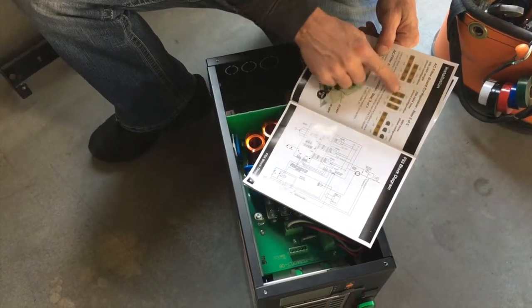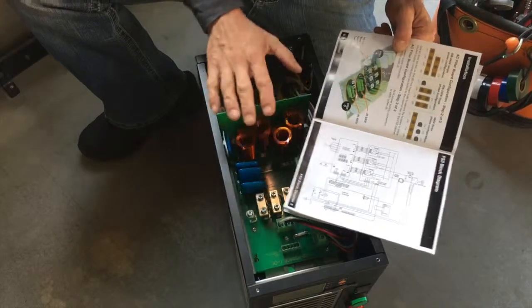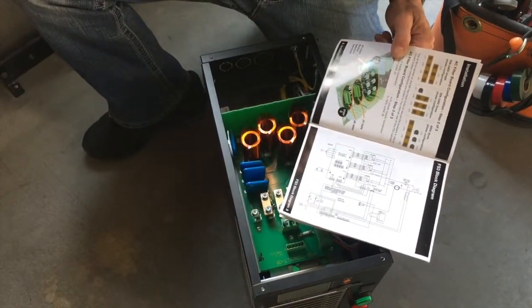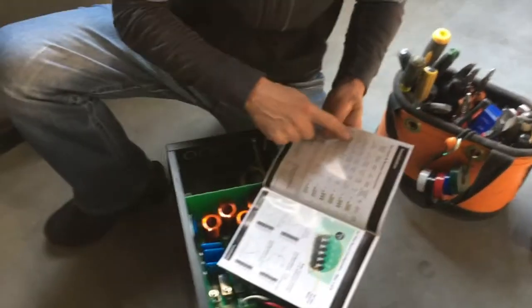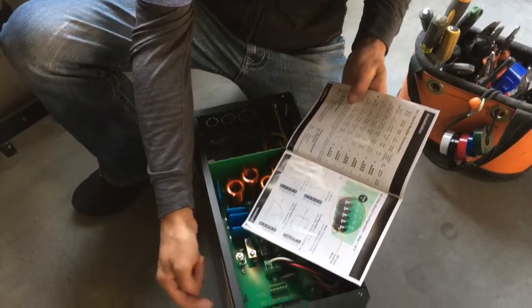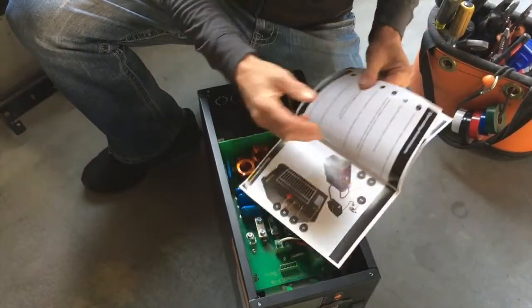Keep in mind they've already configured that 15% voltage drop, because we're hooking it up to 208 three-phase, not 240 three-phase. Make sure when these things are shipped out that you look at what the sticker says for the model. It also showed the bus bar connection right here.